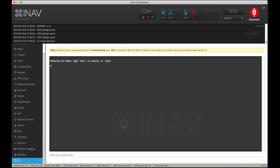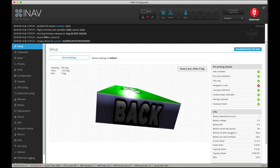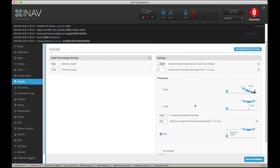Finally there are a few CLI commands that are recommended. These give you more usual performance for the plane — better roll. They are listed on the iNav wiki. Set max angle inclination roll and pitch to 600. Set small angle to 180 so it will arm no matter what orientation the plane is sitting in. Set fail safe throttle low delay to zero. These are just recommendations from the iNav wiki so whether you still need them I'm not sure, but it doesn't hurt to do them. The GPS is showing up in the top bar — it's red because I haven't got a GPS connected, but if it's greyed out you have to go back to Ports and set it up properly.